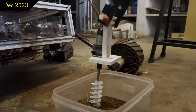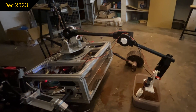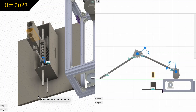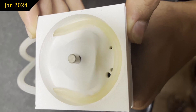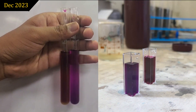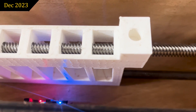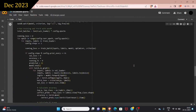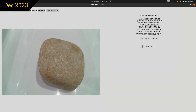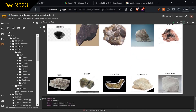For the science assembly, we have implemented a robotic arm with an auger capable of drilling and collecting soil from the stipulated depth. A soil-water solution is made and transferred to cuvettes through custom peristaltic pumps to perform a KMnO4 test for active carbon and a Bradford assay for protein. These cuvettes are then analyzed by a spectral sensor helping identify different biomarkers. Using a Logitech camera, rock images are taken and processed by a CNN model trained on our improved dataset to classify the rock.